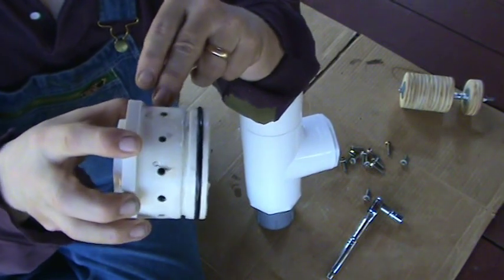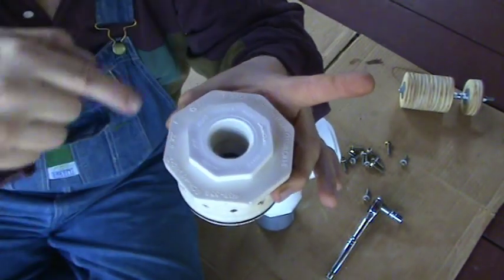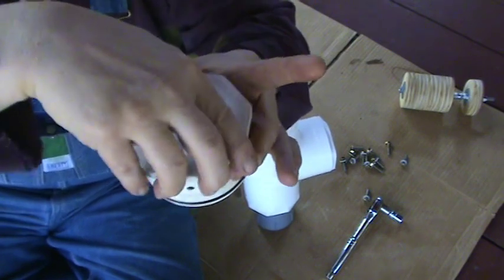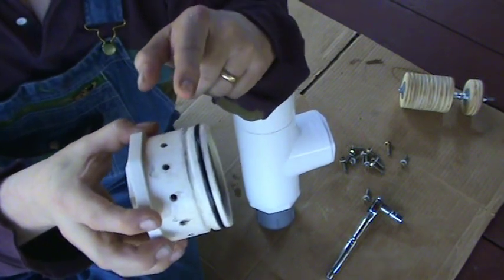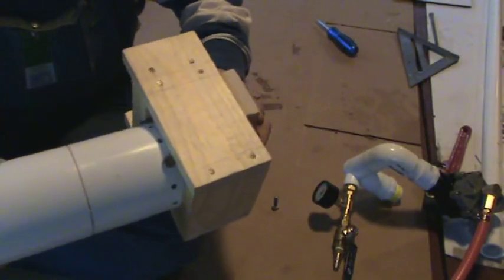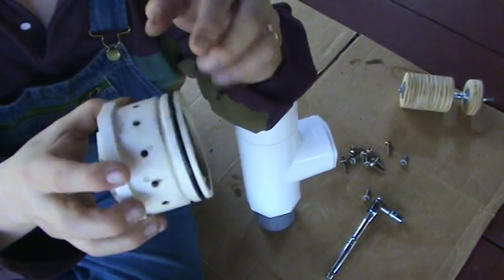The holes were really pretty simple. If you have a drill press, dirt simple. Every 30 degrees will give you 12 points — so I wanted 12 bolts, drew a little circle with the 30-degree marks, marked them, and went around with the drill press: boom, boom, boom. I actually had to make a little container to put this in and run the drill through, which I'll show later in the construction part. Even if you don't have a drill press, you can make a little jig to put the part in, do a hole, turn it, do a hole, turn it, so it's even and neat.